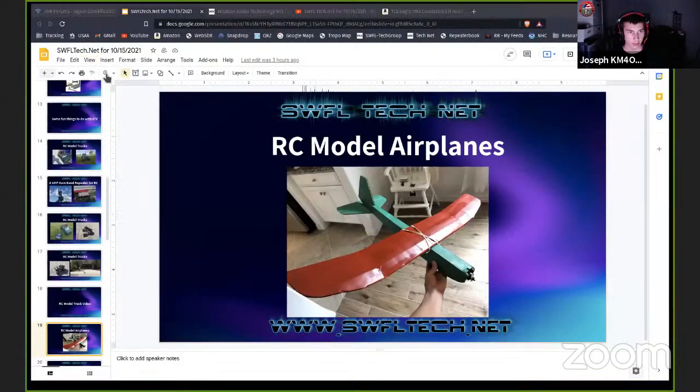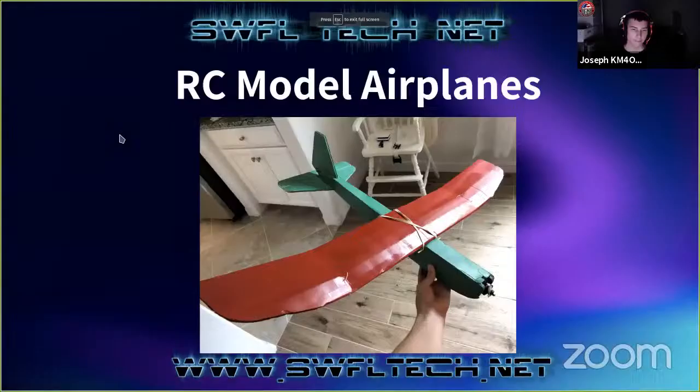Share that, view present. So yeah, you've got to have a nicer camera that has a high dynamic range, and then you can also mess with the camera settings, because if you lose orientation, it can be disastrous. If you lose orientation, you give it a control like a turn left or turn right, you think you know where you're going, but you're not, and you realize it late, and then you start trying to correct for it. It may be too late at that point. You may be too close to the ground. You may have flown into a tree. I've hit a palm tree before, just smack right straight into the palm tree. But these foam planes are nice because they don't really get damaged that much from crashing into stuff.